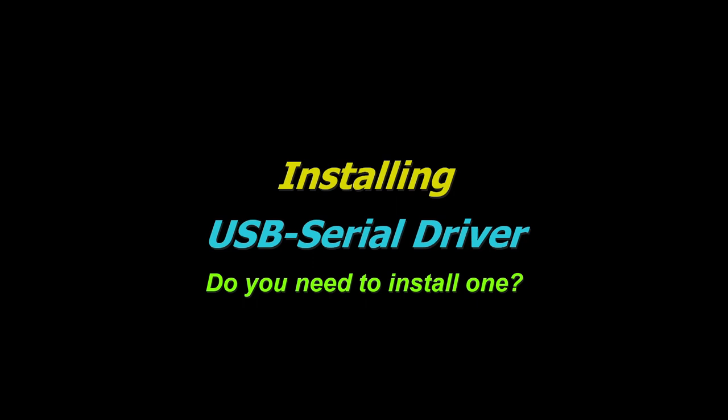Now, which one you use is up to you because you have a couple. There's generally two providers. FTDI, if you want one of them, you'll have to go out and buy a special cable with the chip built in. And for that, you'll have to download the driver you need and set it up as per the instructions from the manufacturer. The other one is Prolific. They also do a cable with a chip in it, but you don't need to purchase one of them. You can either connect to your computer via a cable that connects into the hand controller port, like an EQMOD cable, or one that connects to a USB port, just a USB cable into the USB port on your mount. Because PCs for many years have had the Prolific chip already built into them. So you don't need to actually buy a separate cable if you're going to use Prolific. It's only if you're going to use FTDI.